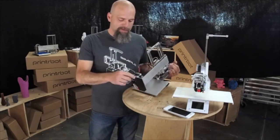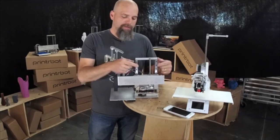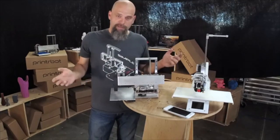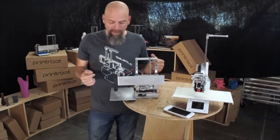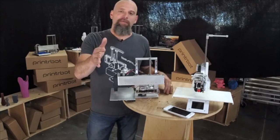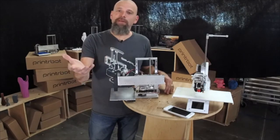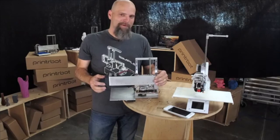This is really, really rigid because these linear rails are more precise and we don't have to use as many plates. We've only got one plate here that holds together both the Z and the Y. This plate on the outside isn't totally needed but it's what we bolt the linear rail to. You can see the screw holes along here — those two things combined really make it rigid and give us something to mount other things off of. It looks a lot like the Smalls but the telltale sign are these linear rails. What's the price? I have no idea — I can't tell you yet.